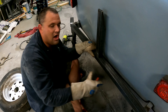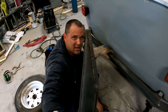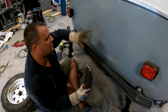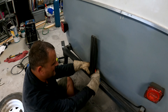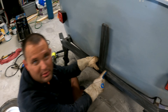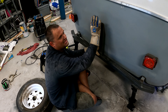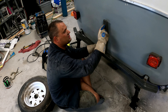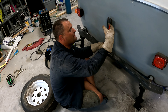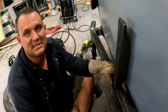Bumper's on, jacks are on. It's a little rainy so we've got to be loud today. I've got my upright — you can see the pie cut I made because the bumper bows out a bit and I wanted it tight. We've got the center of the bumper lined up with the center of the tube. We want the tire to sit as close in as possible — looks like we need about three inches from the surface to the mounting wheel surface of the rim — so we'll build that out with a couple of pieces of tubing.